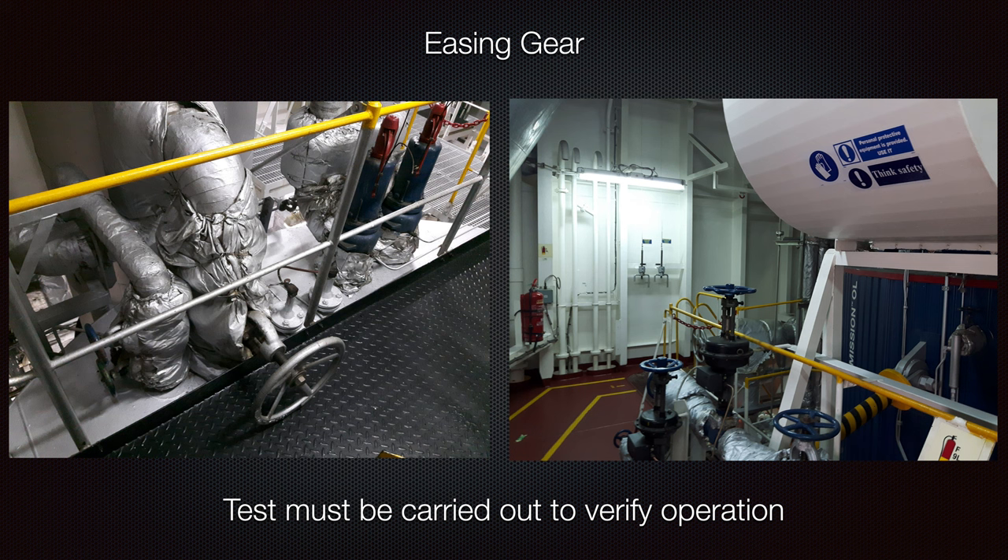The main emergency situation can be when your boiler system goes completely off and you cannot shut down your boiler — for example, if your computer gets stuck and the program locks up with fuel continuously flowing. In that case, you can open the safety valves, or the safety valves will open by themselves as a precaution once pressure reaches a certain level.